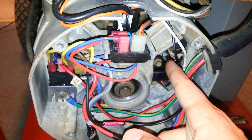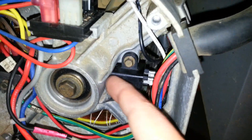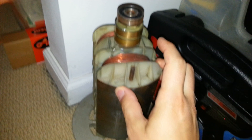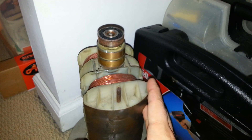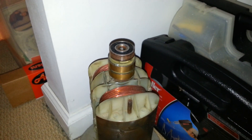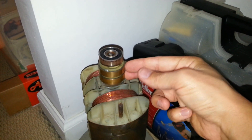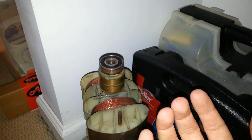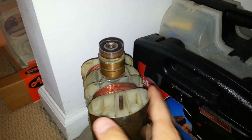You can also measure right at the slip rings. I can't really get a good picture of it, but if you remove the brush assembly, the two slip rings are right there. Here's a better visual — this is a spare rotor I have. If you were to measure between the two slip rings for this particular rotor, you should get about 7.5 to 9 ohms slip ring to slip ring. The two carbon brushes that slip across these rings act as a bit of a resistor, so measuring at the two spade connectors on the side will give you more around 10 to 12 ohms.